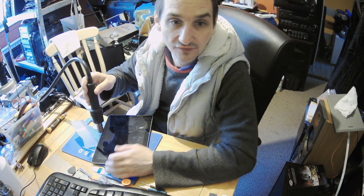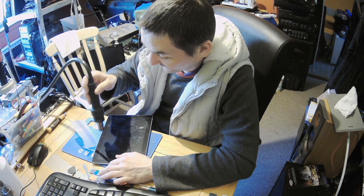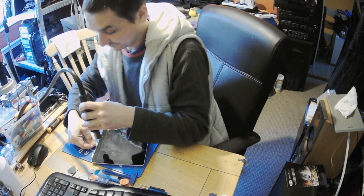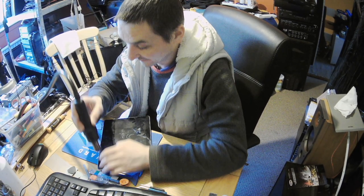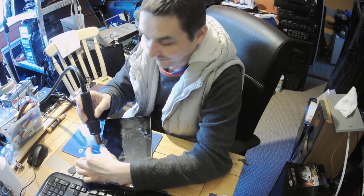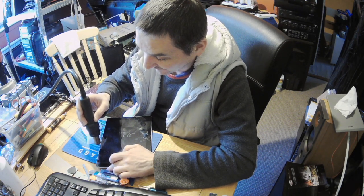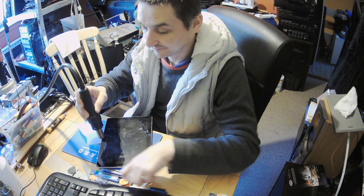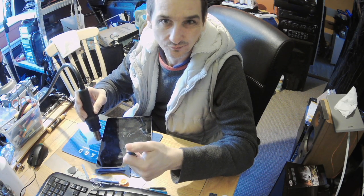And you see I was able to put the polarizer from the TV, so now it's just heating up this section. And you can go slowly across. Heating up, cutting, heating up, cutting. It's not a thick line over there, it's just a tiny line. So if you can cut a bit, that's fine. You can insert something, or some thin metal, as long as it's not super sharp.